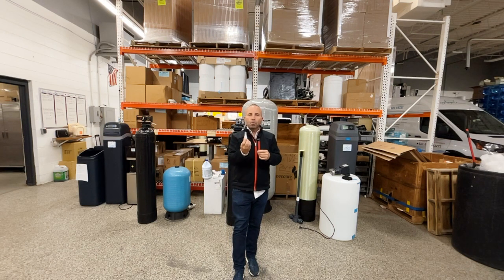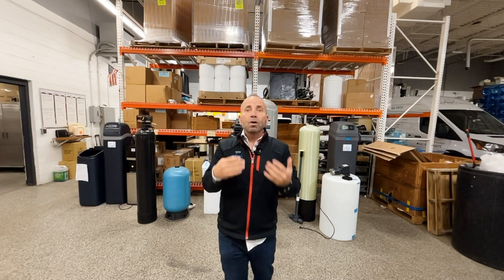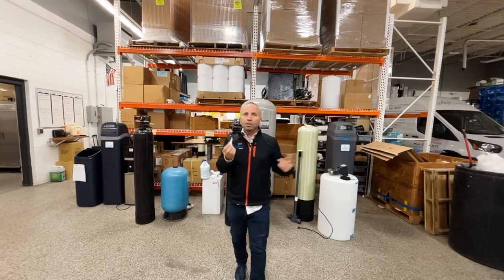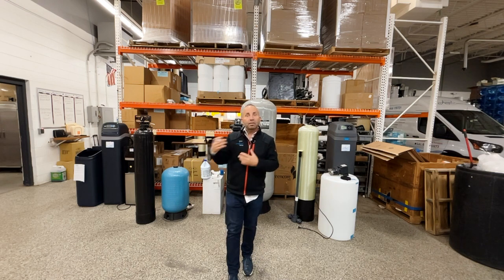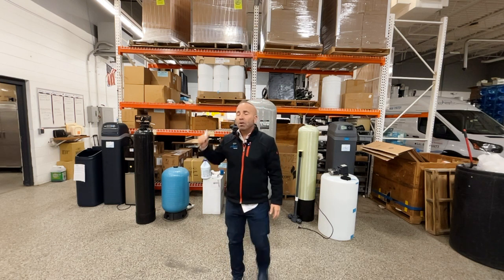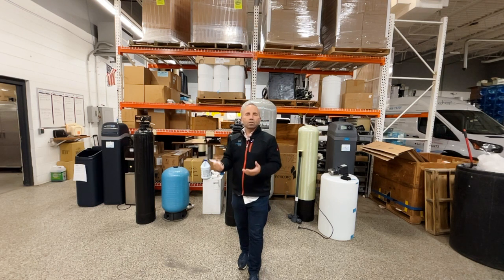The injection point, the pump, the band on the pump, they have to be replaced by manufacturer's requirements once a year. So what we do is we come out once a year, we change these tubes, we test the water, we check the integrity of everything, we lube up what needs to be lubed up, we check the diagnosis. It's a lot of things we do once a year, rather than multiple times throughout the year in systems that are actually inaccurate in dosing the chlorine into water.